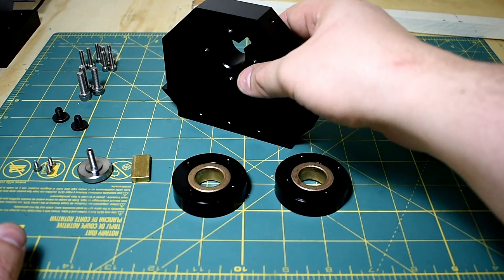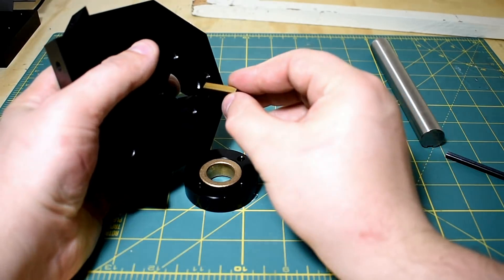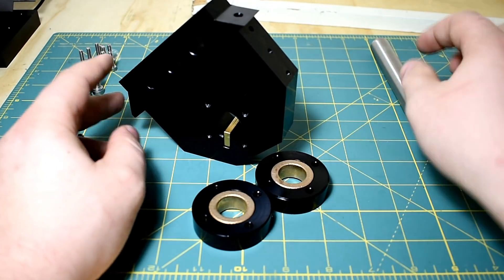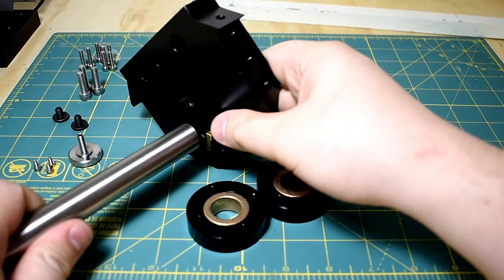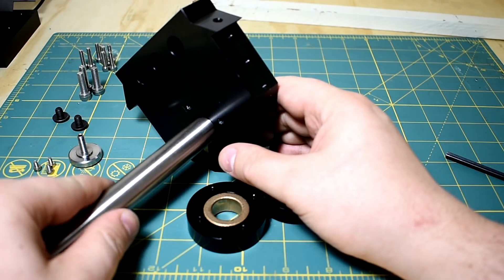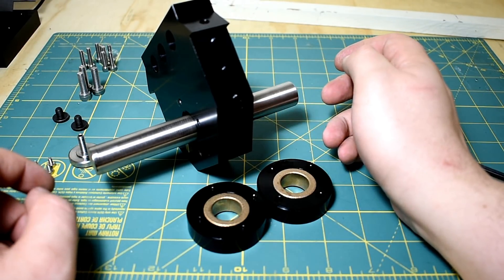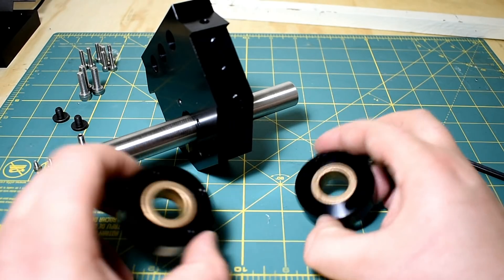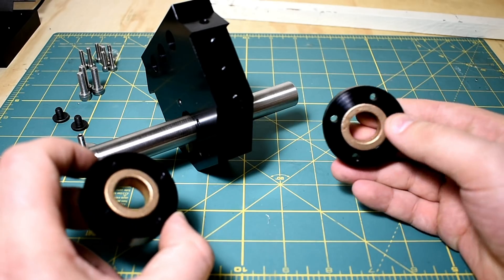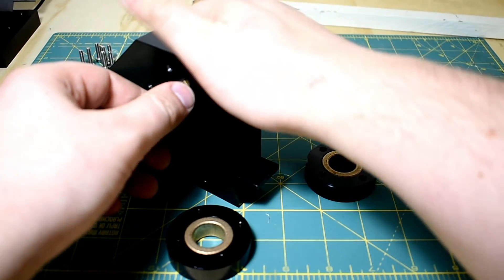The tailstock has this housing here with a brass keyway. The black anodizing isn't great to film, but I've got a brass keystock in here, and this is actually a keyed stainless shaft. These fit together so you can slide the tailstock without it rotating. That's held in place by these bushing caps — oil-lite bushings pressed into custom-made flanges.